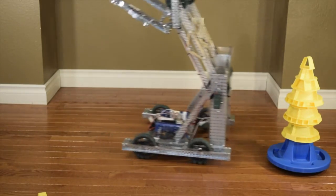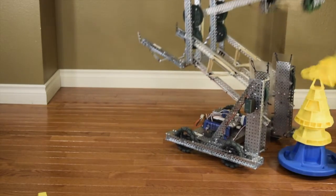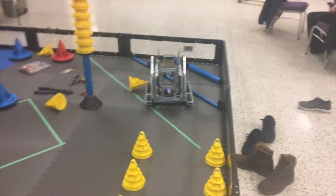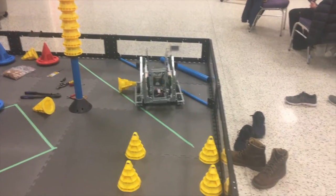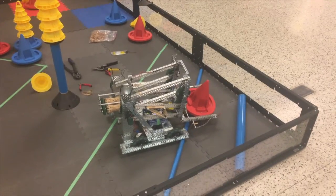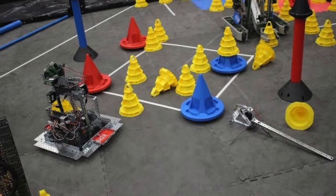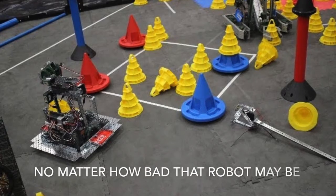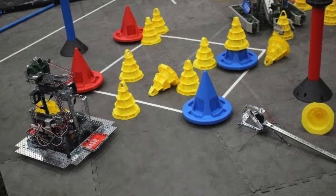Tip 10: Don't be afraid to tear your robot apart and start from scratch. I've torn our robots apart enough times to know that sometimes tearing a robot completely apart is the only way to improve it. If your robot is slow and not competitive, it might be time for a complete redesign. Look at the current meta and do your team's take on it. Don't overdo your skill level — if you can't figure out how to make a lift, use a simpler one. I failed twice making a double reverse 4-bar before finally figuring it out, so we ended up using a six-bar. However, if you have a competition in a week, maybe wait until after to redesign. Always have a working robot for competition. If you absolutely need to make major changes, try simpler improvements rather than tearing the entire thing apart.